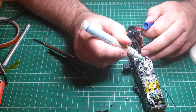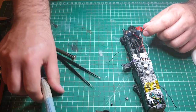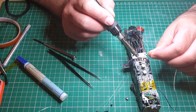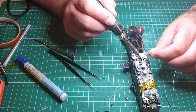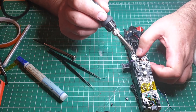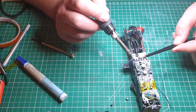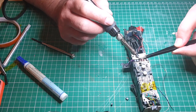Here I'm adding the black and red feed wires for the decoder, which I've cut on the small harness, up to the PCB board. The two center tabs there are where the motor bogey attaches. So there's a black and a red wire there already. I did try threading through and using the plastic clips, but there wasn't enough room. Ended up soldering. A little bit fiddly, and a bit time consuming. Just take your time doing it.